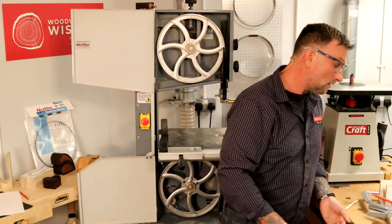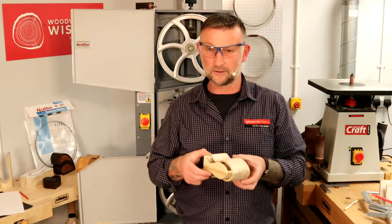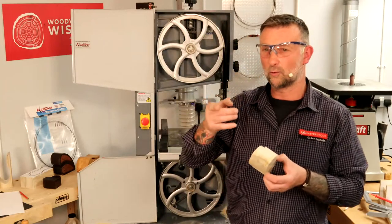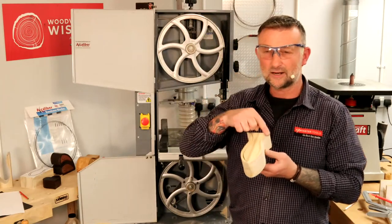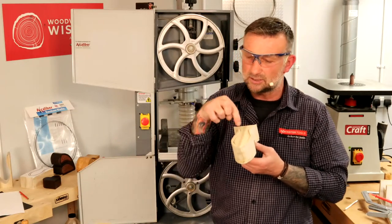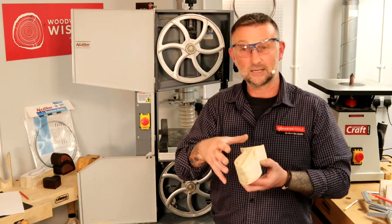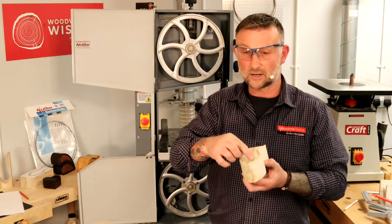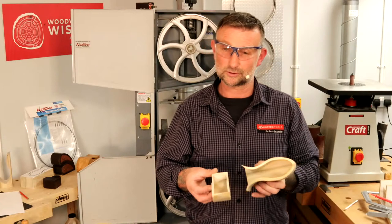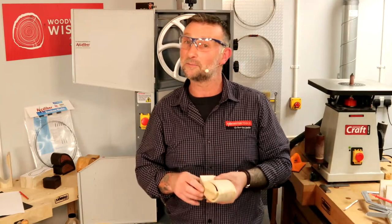Okay. Have we any more questions? Okay, for the moment. Well, guys and girls, we have an introduction to bandsaw boxes. Why don't you go try this? You can use 1/4-inch blades to roll around some of these cuts. Certainly the outside of this shape, you get away with it, but this tight spot in the middle might be a little bit tough for a quarter inch to roll around. It's easy. Just make it slightly bigger. Make that curve slightly wider. But there you go. A nice, simple bandsaw box project. One that's really going to get you going in bandsaw boxes. And trust me, they can be a little bit addictive.